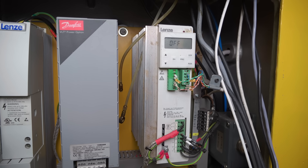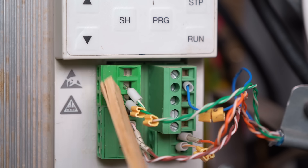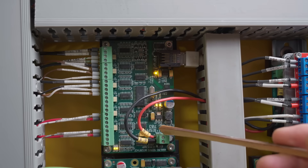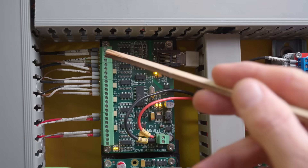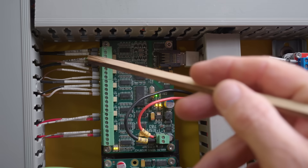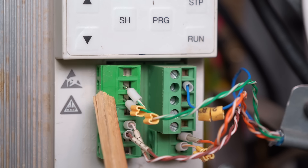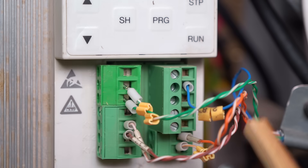This is a pretty simple and primitive VFD. You've got three-phase 400 volts coming in at the bottom, and three-phase motor output coming down this wire. There's an input filter and some sort of output filter. Up in the control section there are two wires — the green and white pair are the actual speed command, controlled by the Mesa 7i83 analog output card, giving an analog speed command of 0 to 10 volts providing the speed range.